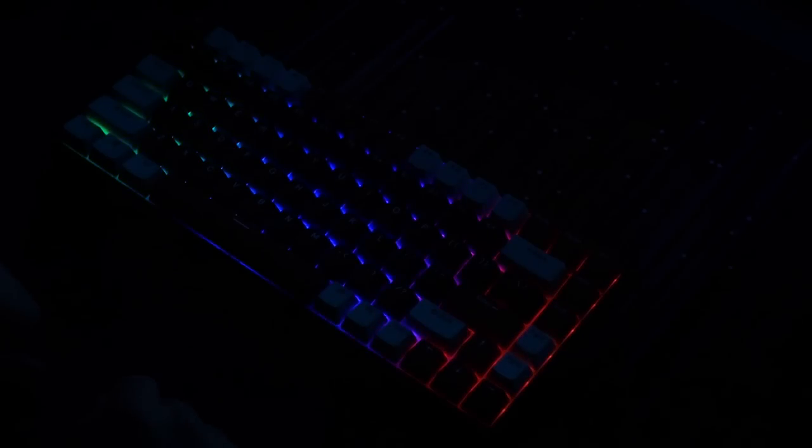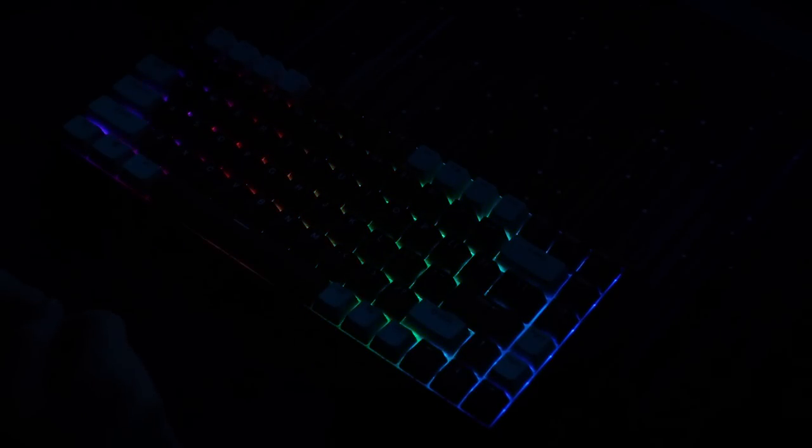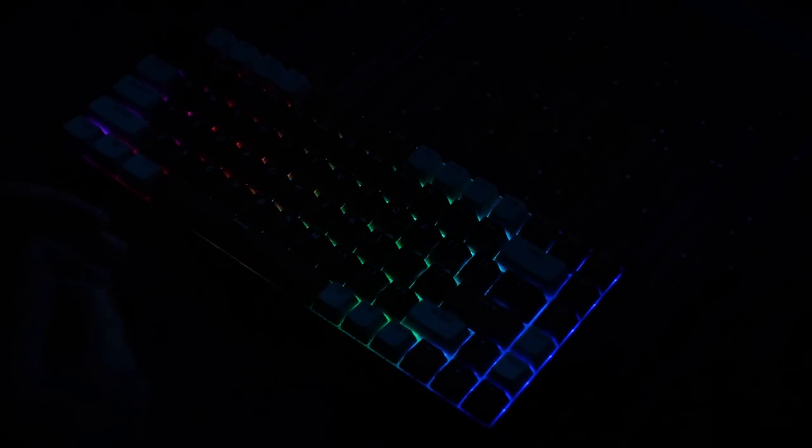There's no visible flickering. If you are seeing a little bit of flickering on the camera, that's totally normal. It's not visible in person, not visible IRL. It's simply the result of an interaction, an artifact of the frequency of the LEDs and the shutter speed on the camera. I will say, though, that looking in the viewfinder, I don't see much in the way of flicker, so hopefully it's not very visible to you, or perhaps not present. And that is a good thing for people who might have this keyboard on camera. If you're a YouTuber or streamer and plan to have your keyboard in frame, it's important to have one that's not going to be a flickery mess on camera.